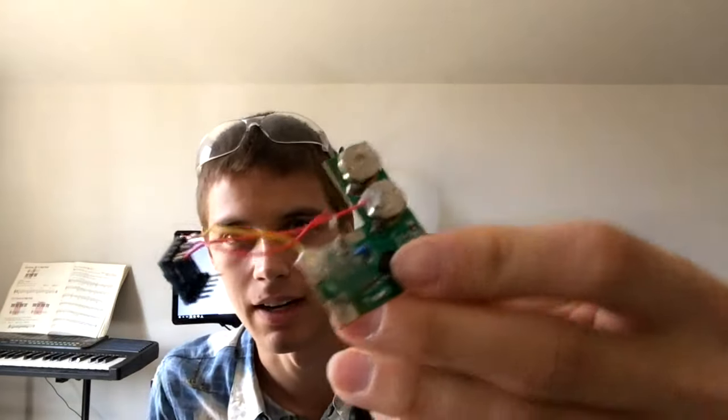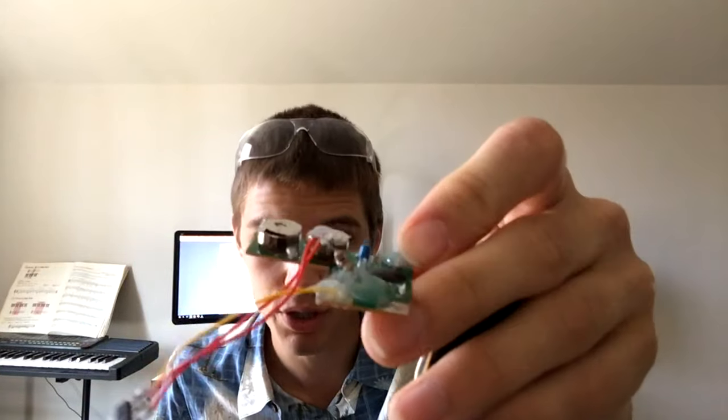So these are Wilhelm's completed guts. He's already yelling. He knows that he's going to be thrown repeatedly once he's done. He doesn't even have a body yet, and he's screaming. But this is the accelerometer that is detecting the falls, and many falls as I'm picking this up and throwing it around. And this is the audio playback unit, which I have attached to the accelerometer in place of the switch that normally would fire the audio playback. And I've done that through a little bit of a filter.